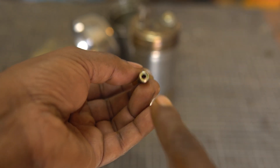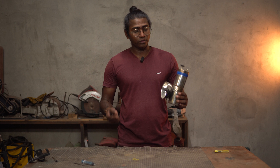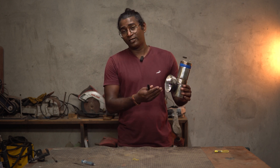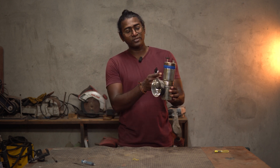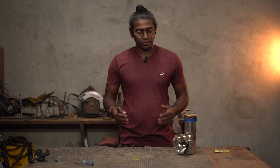However, this hole should not be this big and we are going to fix it. Do not take this step lightly. At this stage I was quite excited and wanted to do a test run, so I lit it up on flame. There was a flashback and the top part just flew up in the air. Thankfully I did it outdoors so there were no damages or casualties. So you've been warned.